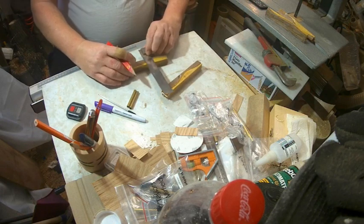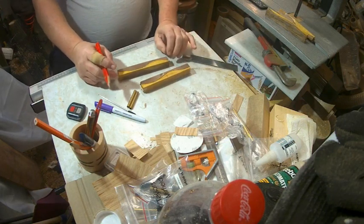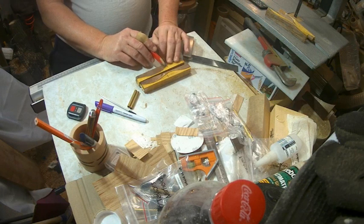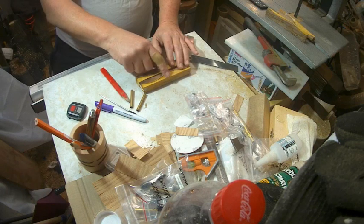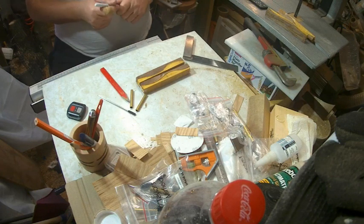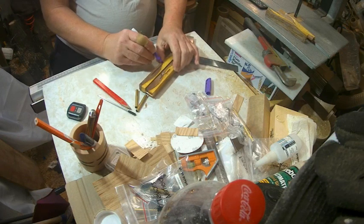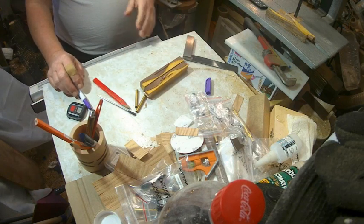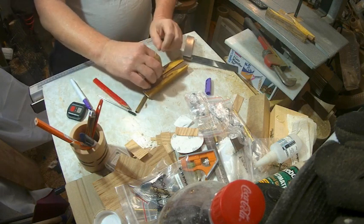Now when I cut these and put the tubes in, you'll obviously have to trim the blanks to the barrels, but I'll show you when I put the tubes in. To try and keep the grain alignment and the pattern alignment, I just touch the ends of these with a barrel trimmer, but before we do anything, always scribe a line down the middle of your blank, and that way before we start turning we know that the blanks will be aligned perfectly. Okay.